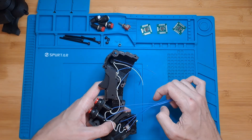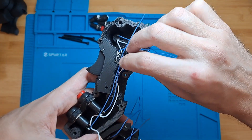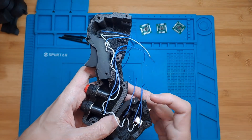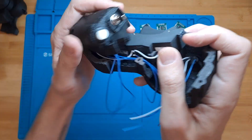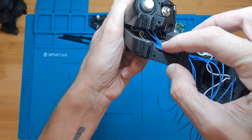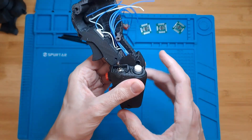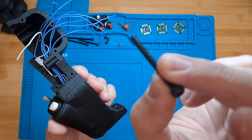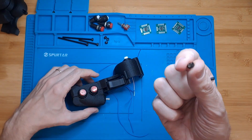What we are going to do now is close the two halves. We are going to fit the wires through this gap here. Make sure you don't pinch them — there's a section where it's going to be closing, so make sure you don't pinch the wires. To close this we are going to need one M4 by 45mm screw and one M4 nut.